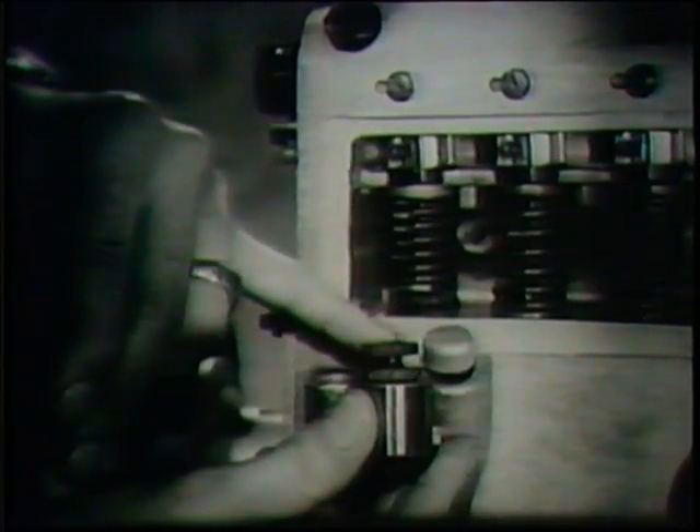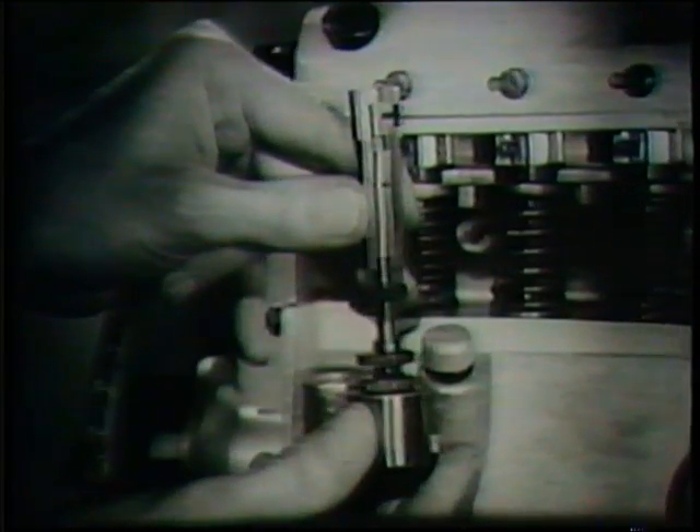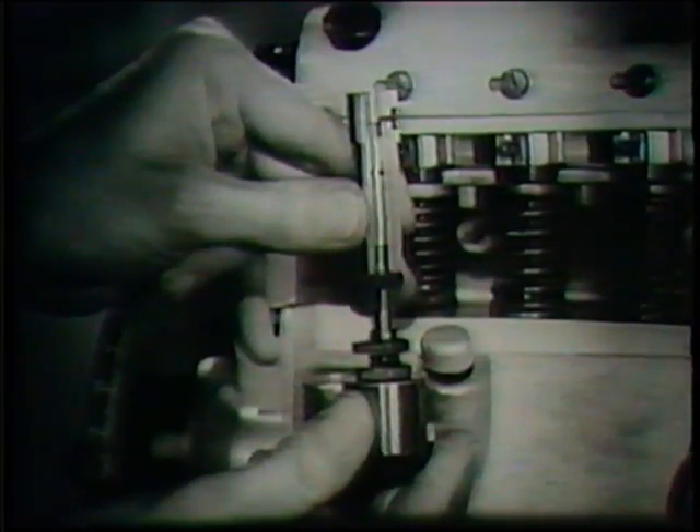The existence of this movement, which can be adjusted by means of the tappet screw, is extremely important in order to avoid the end of the plunger protruding through the barrel and hitting against the bottom of the delivery valve seat.